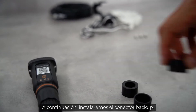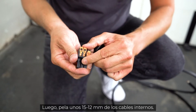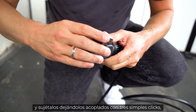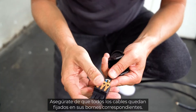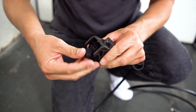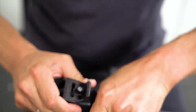In the next step, install the backup plug. Remove approximately four to five centimeters of the cable sheath, then strip approximately 12 to 15 millimeters of the inner cables. Pull the cables through the individual components and fix them with three simple clicks — completely screw-free. Make sure all cables are fixed to the respective terminals. When all cables are in place, push the terminal strip into the housing of the plug; when you hear a click, the terminal strip is properly engaged. Finally, tighten the fasteners.